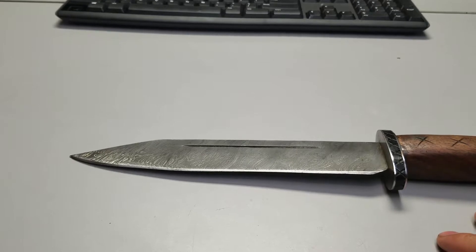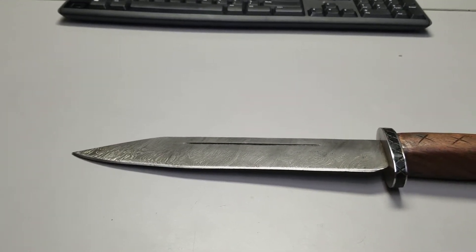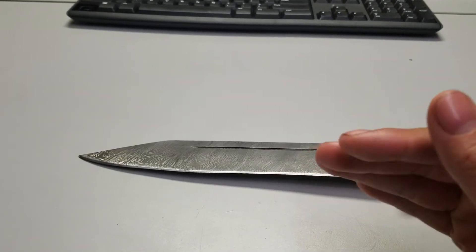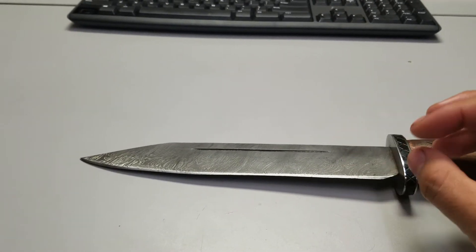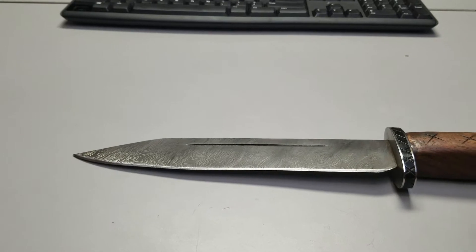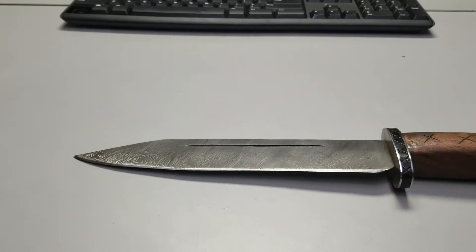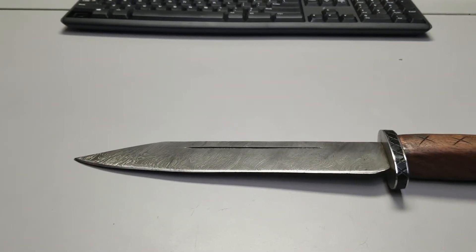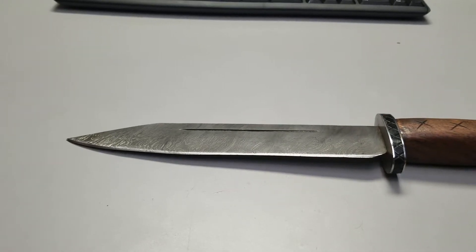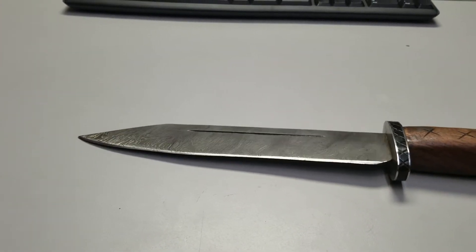Moving on to the properties of Damascus and modern Damascus: you forge-weld low-carbon and high-carbon steel, then fold and pattern it. There are a few different ways to pattern Damascus. One is an alternating Oreo-like layered pattern — you fold it, hammer it flat, fold it, hammer it flat. Another is raindrop Damascus, where you use a drill press to drill holes at slightly varying degrees of depth, though if you drill too deep you'll create a flaw in the blade. Raindrop looks like wave patterns of rain falling on the ground. What I'm showing here is closer to a ladder technique.